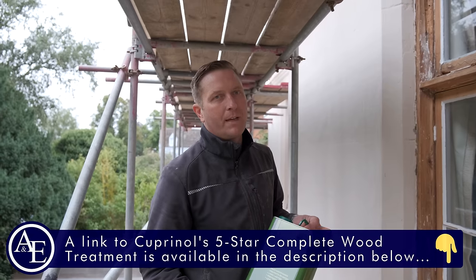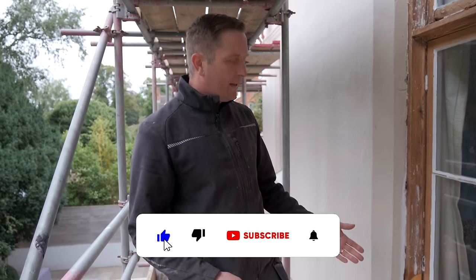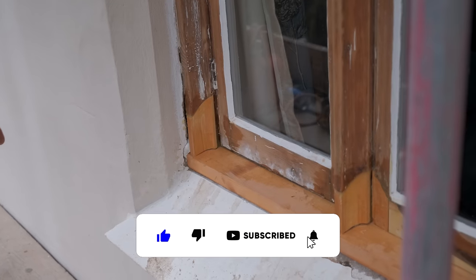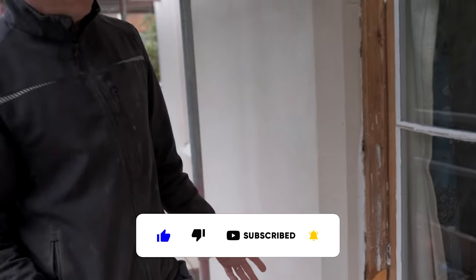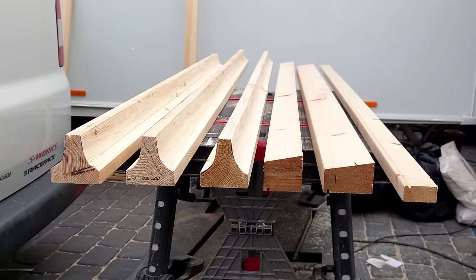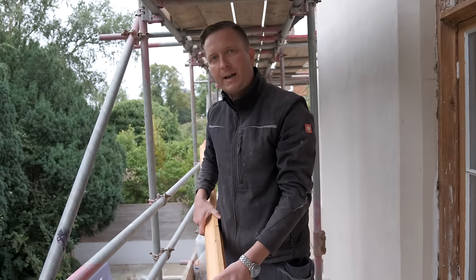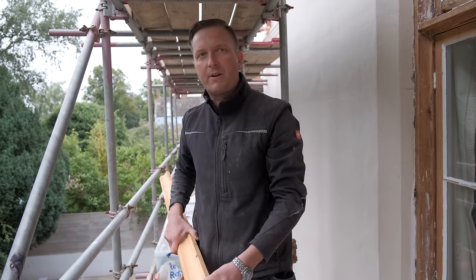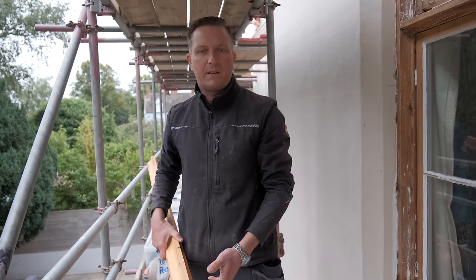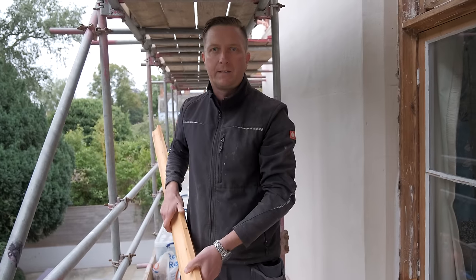That's a really important thing — a lot of people don't treat it. You've potentially left something in there which will continue rotting. That gives the preservative a chance to dry, because the resin repair that we're using won't stick to it when it's wet. Then I'll come back with everything machined. All these mouldings have been machined by me. They're only small quantities so I'll machine them on a table saw by hand — it's not worth having cut for just three or four lengths. It takes me like three or four hours; I could spend that driving to the joiner shop and back.